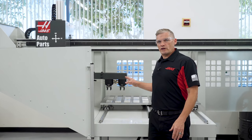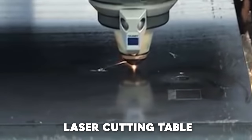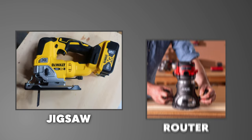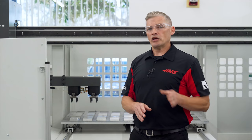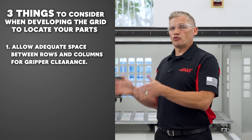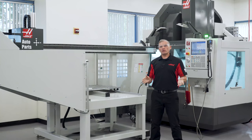As we mentioned earlier, you'll need to create custom templates and grid patterns to match the parts you'll be loading. You can create a template out of sheet aluminum or steel using a plasma cutter. If you have access to a laser or water jet table, that would make this even easier. Another simple low-cost way is to make measurements on a thin sheet of plywood or cheap plastic, and then make your cutouts using a jigsaw or router. Pegboard-style layouts and similar approaches could also allow for adjustability in the positioning. Whatever method you choose, here are three things to consider: first, allow adequate space between rows and columns for gripper clearance; second, all rows must have equal spacing; and third, all columns must have equal spacing as well, but it can be different than the row spacing. With all that we've covered here, we hope that you'll be up to speed using your APL right away and enjoying the benefits of your newest operator. That's all for now. Thanks for watching.